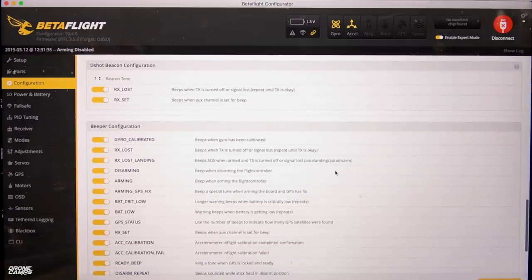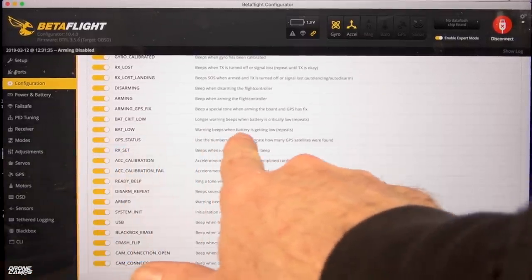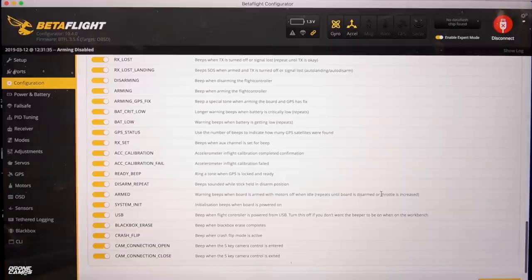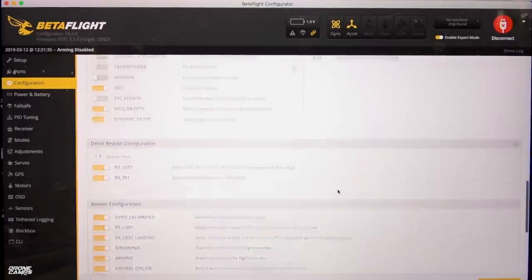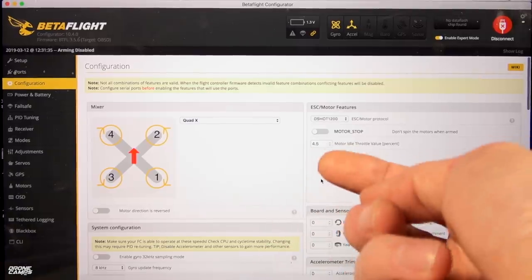Make sure that your video transmitter is not cranking out 800 milliwatt on a hot day because you could burn up your video transmitter waiting for your satellites to load. That's why smart audio on this quad would have been nice. Give yourself about a minute before you take off, and also make sure that your arrow pointing to home is actually starting to work. The way you make that start to work after you have a lock: arm the quad, let the motors spin for about another 30 seconds or so until you start to see that arrow moving around and showing you two to three feet away from the home point.